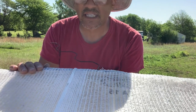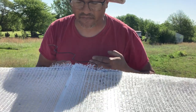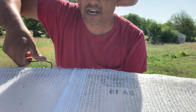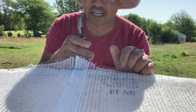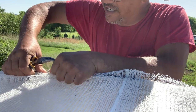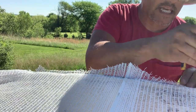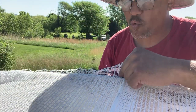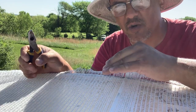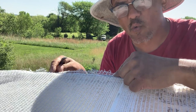I've put the rib dead center and started a piece of wiggle wire here just to hold it so it doesn't move. I'm pulling just an inch over the side - if there's any excess I'll cut it on the back side. I want the entry side to be nice and neat, just a couple of inches over so I have a handhold to pull it tight. Installing wiggle wire is just as simple as that. Always keep a pair of pocket pliers because the last piece is always the hardest to get in and hard on your fingertips. There are three pieces of wiggle wire in this tracking - one for the plastic, one for the end wall, and now one for the shade cloth.